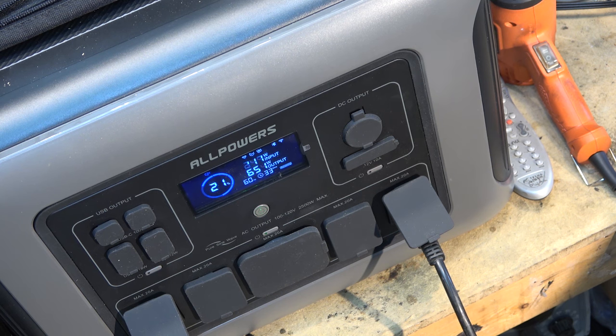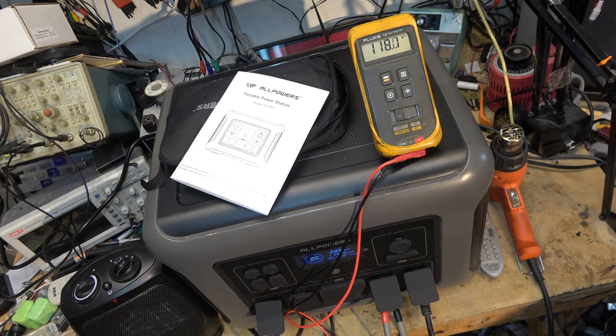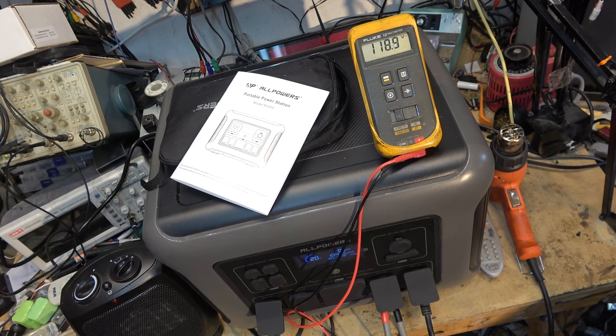Unplugging the power again — nothing changed. Going back to full power I'll turn on another load. Drawing 1600 watts now — I'm over the maximum input so it's back on battery. If I shut off the other load it should switch into UPS mode again. Now we're in UPS mode, plugged into AC running at 118 volts. I disconnect the power and the voltage drops to 110 volts coming off the inverter. Back on AC power it goes back up to 118 volts.